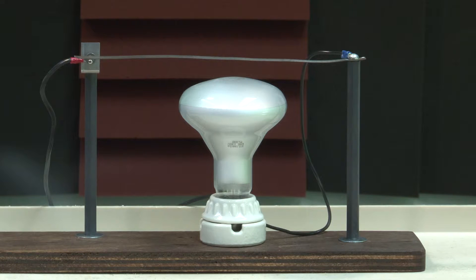So let me show you now. I'll zoom in and see how you can make a circuit breaker out of this design. When you look a little bit closer, you can see that on the top of my device I have a bimetallic strip, and the contact in the circuit is being made at this pin here.